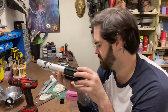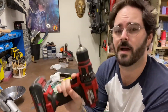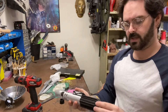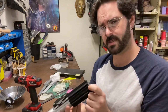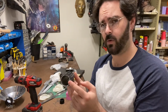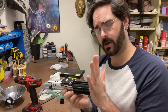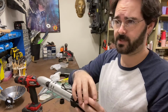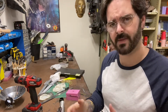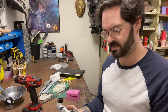And I'm gonna do the same thing with my little M3, wherever it went. Oh, it's still in there. My M3 tap for 2 screws that'll go into the base here, or into the end here, and they're going to be threaded through the wall of this tube, and then threaded into the end cap plug. That's gonna hold everything in place. It'll be 2 little Phillips head button screws. We'll go through with that. And that'll look really, really nice. That should give it a really finished look, but also hold everything together really nicely.